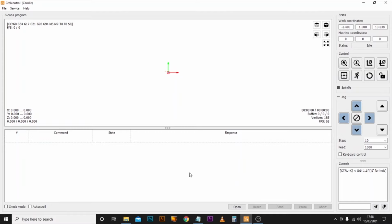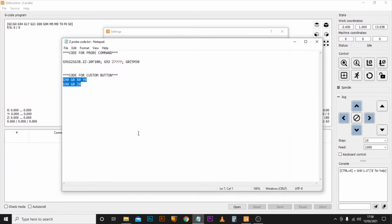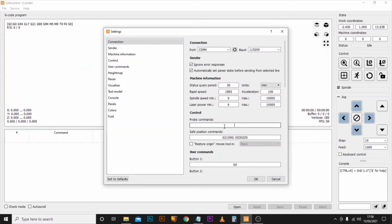Now what we want to do to begin with is come up to the service and settings menu. And in here we can see that we have a probe commands line. What we're going to do is insert basically a string command just to tell the Z probe what to actually do. I've got this preloaded in a notepad file, and as always I'll provide this in the description area. So we're going to copy this first line, which is the code for the probe command. Control C, come back to Candle and paste it into this top box, Control V.